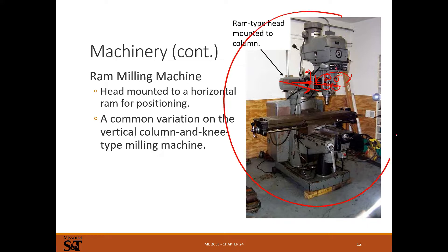If you want a machine shop, you need one of these mills and a lathe. They come in different sizes — anywhere from one to four or five horsepower, with two horsepower being pretty common. You can get these with power feed usually on the X-axis, or converted to CNC. We've got one of those in the student machine shop for design classes — it's a really great machine. Some of these will run on single phase, though mostly three phase.